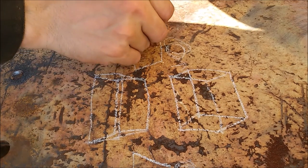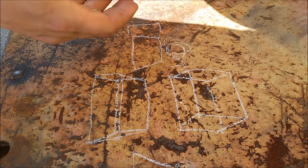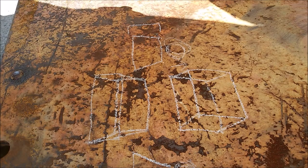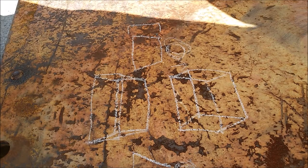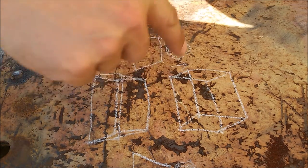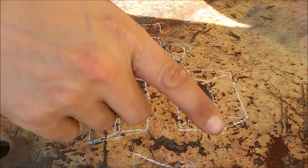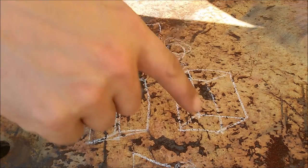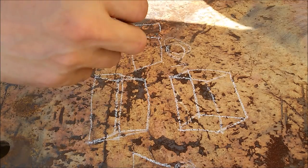You know, proper process planning and setting things up is why I draw out pretty much every single project that I have. Proper step planning, proper process planning, and then especially if I have a lot of these to do, which I've got 8 to do, I've got to figure out the best way to mechanically and industrially get these things done. Which doesn't mean cut all the pieces for one, then assemble it, then weld it. Usually, my process, if I've got 8 of these things to do, I will cut out 8 times all of the pieces that I need, and then put them all together, and label them and put them in their proper stacks of piles.